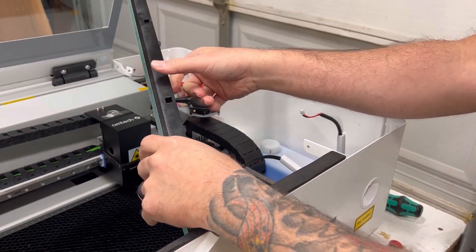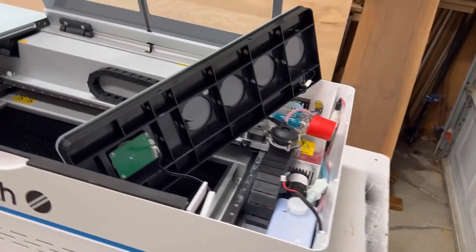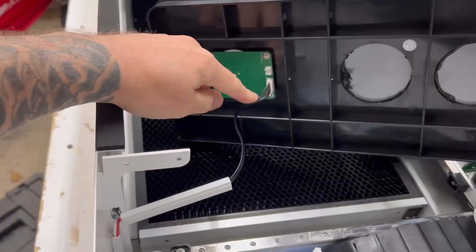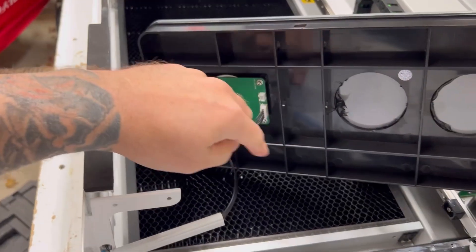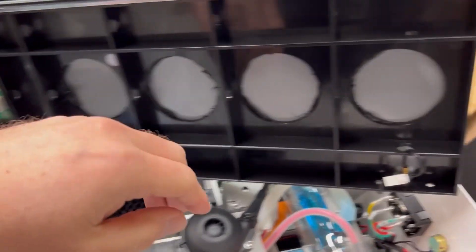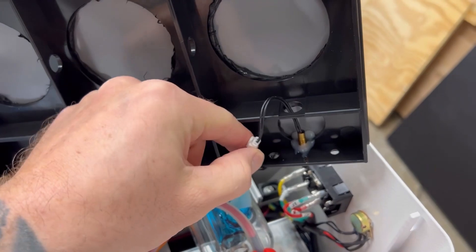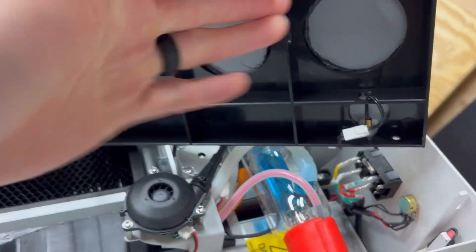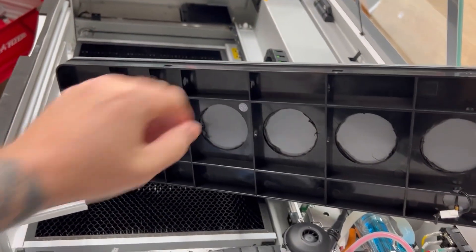Here's the back side — here's the additional wiring to the push button on the other side, so there's still a connector there. And here is the door sensor with the wiring that I was telling you about that I couldn't reach. We really don't need to disconnect those; we just need this board out of the way.